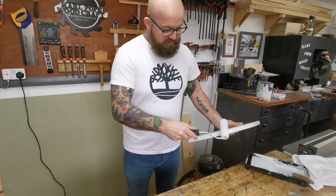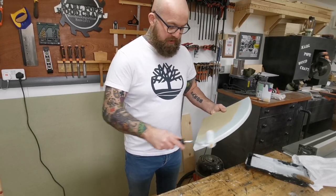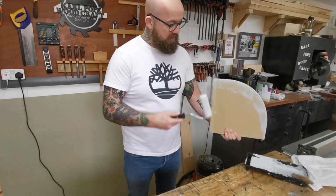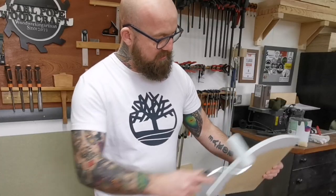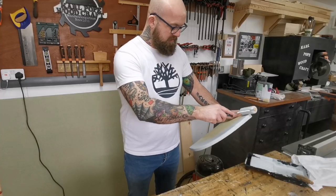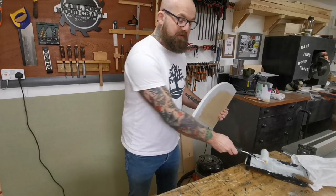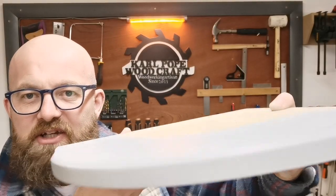Dust off, then re-cut — this is the second coat, one more to go. For the final coat you can probably guess: de-nib at 240 and apply a thin coat, then just feather it off nice and smoothly making sure there's no paint build-up on the edges. Leave it a couple of hours, de-nib, then apply the next coat.